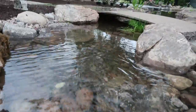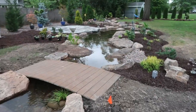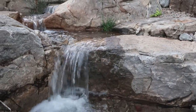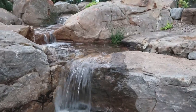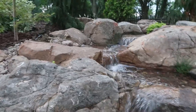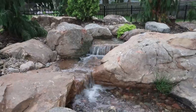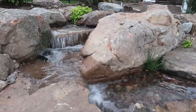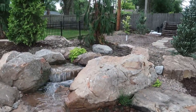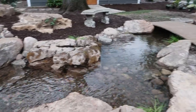We've got about eight inches of water going into about a foot of water, then it shallows up just on the other side by that bedrock area over there. And then, of course, just a very simple, elegant waterfall — starts off with a big sheet, veil-style falls. We've got one coming in at a 90-degree angle right behind it. Two rocks, two rocks, and then a more standard-style waterfall with our frame rock, frame rock, and just a big spillstone, with the spillway buried all the way back in there. We've got some Creeping Jenny and Rush and other plants to soften up the edges. It just turned out spectacular.